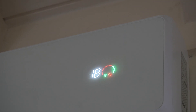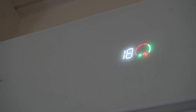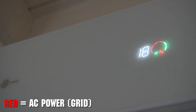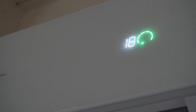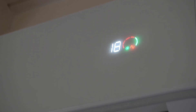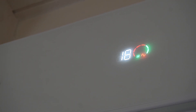Because we have two panels shaded, it's not getting sufficient power from the solar panels consistently. And there you go — you see that red indicator with the sine wave, and that shows that some of the power is being supplied by the grid. It's getting some from the solar panels, but because of that shading, it goes back and forth to the grid. It doesn't drop the solar panels completely — it just pulls what it needs when it needs it from the grid.